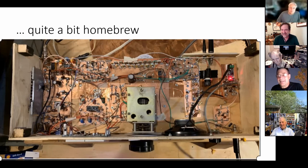So speaking of the LM386 in your audio, Dean thankfully put an AGC circuit in here because I've noticed you really have to ride the volume knob. Do you have any kind of AGC built into yours? I followed Farhan on this. Farhan, from the BitX 20s on, he would say, I don't put AGC in this. I don't think it's necessary. I think it's a frill. You could turn the gain control down if you want.